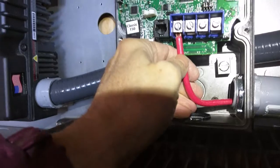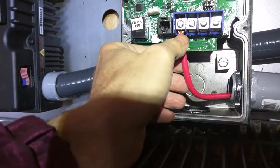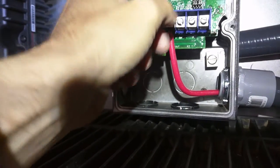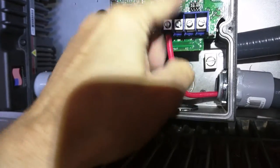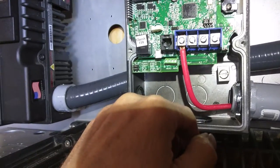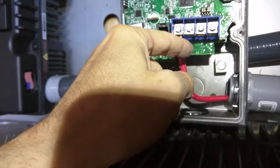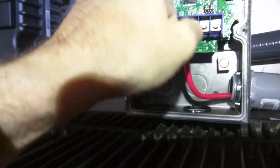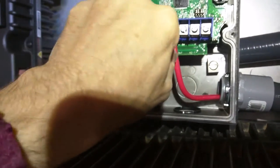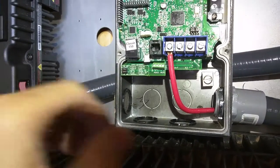This one's already been done so it really won't do it, but if you're doing a freshly stripped wire and sticking it in there and cranking it down fairly tight — you don't want to bust it off the circuit board of course — just crank it down and then wiggle it left and right, up and down, again without busting the board. And you'll be surprised how much extra you can turn that screw. You do that several times until it doesn't change much anymore and that should be a pretty secure connection.